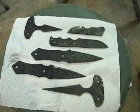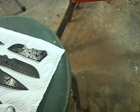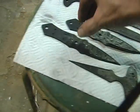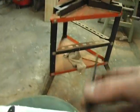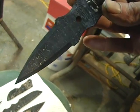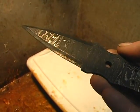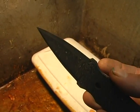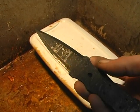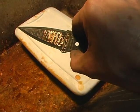So here's what we did today — turned out very nice, I think. Sometimes I'll take these after etching and actually come back and re-grind the cutting grind, which will take away the Damascus pattern and make it shiny like stainless steel, but it's a nice contrast sometimes. But most of the time I prefer to leave it where you see the Damascus pattern. And of course, if you ever do screw up on anything, you can always grind it down and start over again.